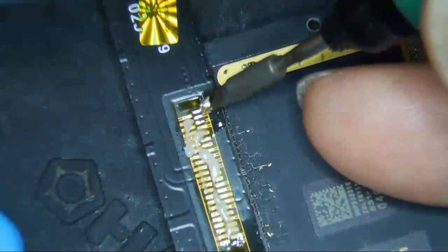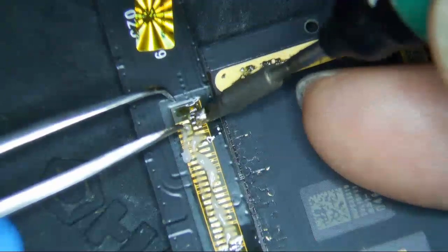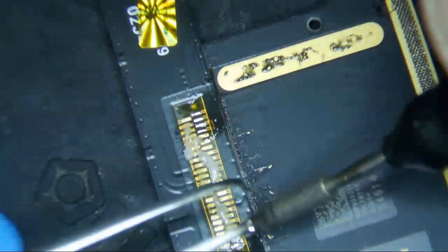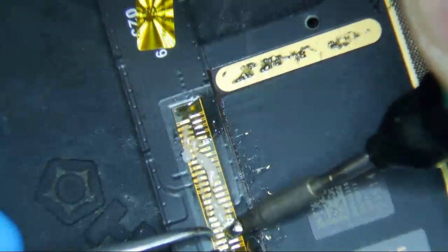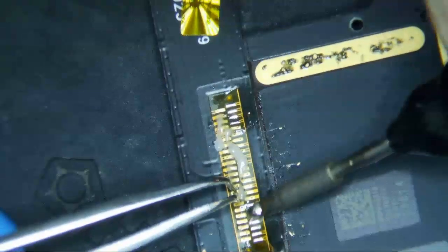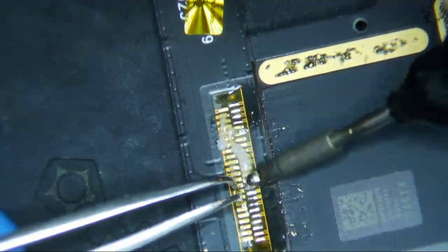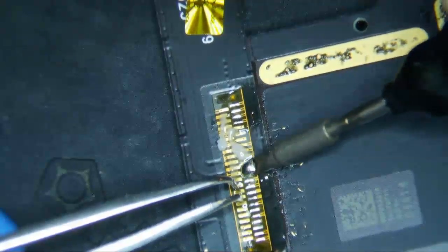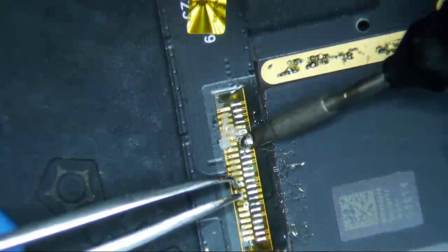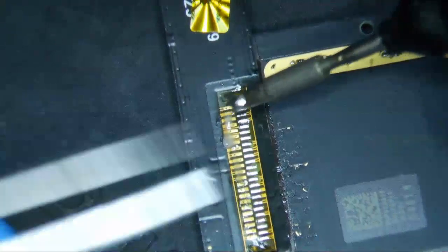I'm going to tack on two ends and then just go to town on them. I do two pads at a time and push down on it, making sure that little circle doesn't show through — which means the pad and the bottom pad are soldered correctly. I apply some light pressure on top and go like that. I'll usually do it twice, and that's usually sufficient. Make sure you use enough flux, otherwise you're going to get a lot of bridging.